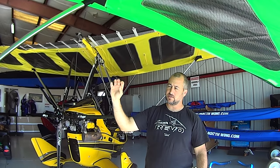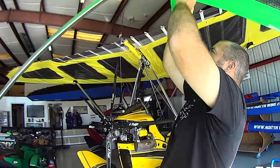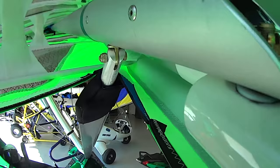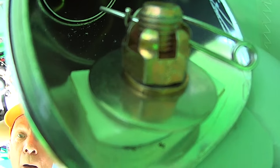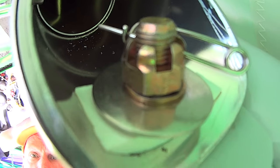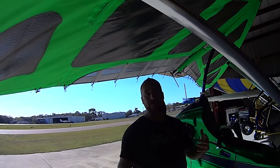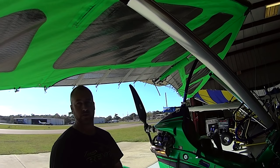It's a series of sleeves — doubled, tripled, and quadruple-walled — with the crossbar now at five sleeves. Back when we were building 950-gross-weight wings, cross tubes were just double-sleeve. As we moved into the 1,160 gross weight category — and some wings are now even 1,200 gross — the cross tube is always the weakest link. When you add thousands of pounds of load, the cross tube is almost always the first to buckle and snap. Now that it's tripled, the weak point may move elsewhere, but it's a very beefy cross tube because that's where you need the strength.